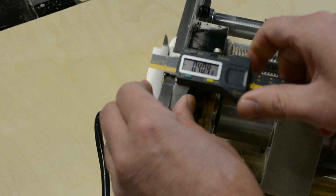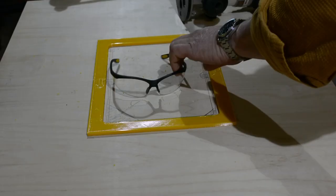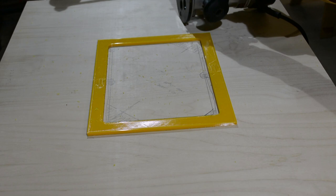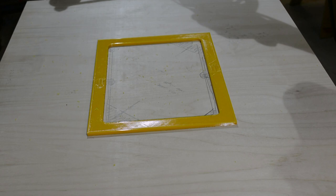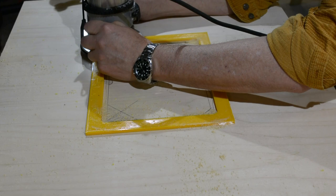I've got to measure the thickness of the router lift and add a small margin to it so that I can use the adjustment screws to bring it flush. With the same ultra-small patterning bit, I'm going to follow the pattern first, then remove the template and follow the cut for a second pass to get to my final depth.